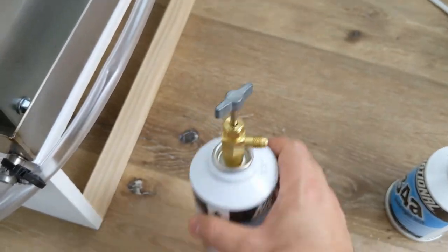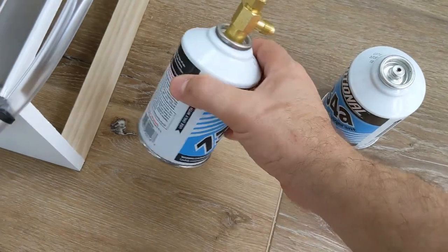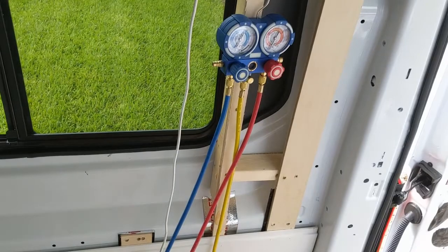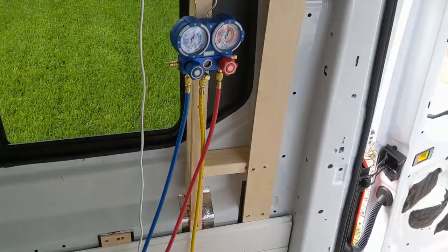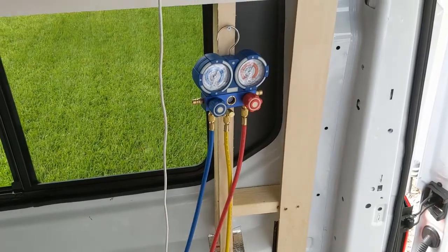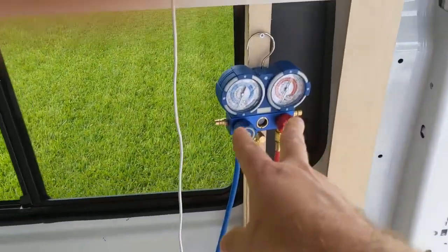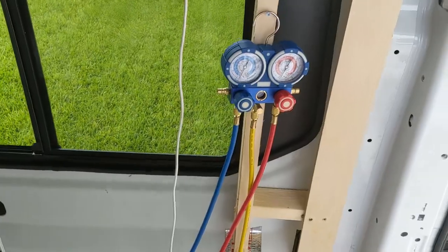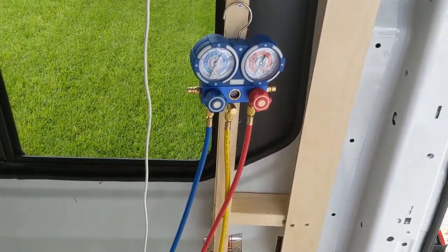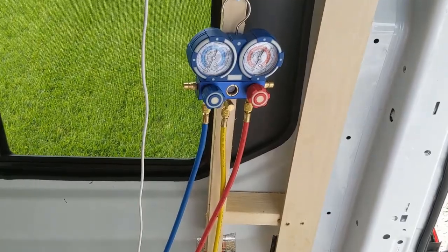The first can is different than a car AC — we're going to leave the AC system off and hold the can upside down to allow as much liquid as possible into the system while the AC is off, with both valves open. Not just the cold side — both of them need to be open for this. That's what Cruising Comfort says, and I'm going to listen to them. I'll be back in the next video in about 15 minutes to start the charging procedure.